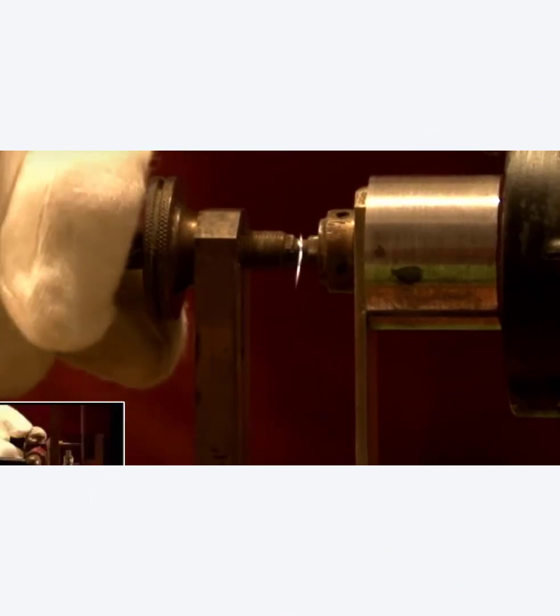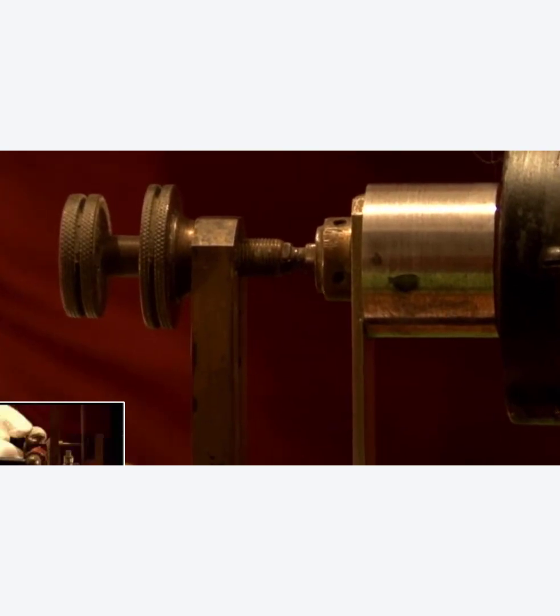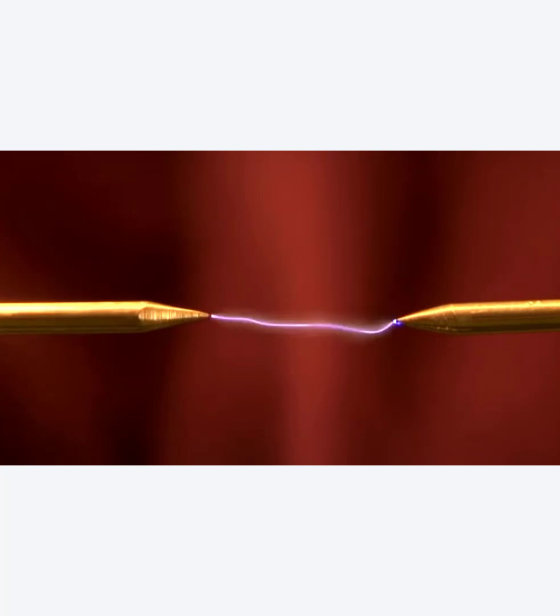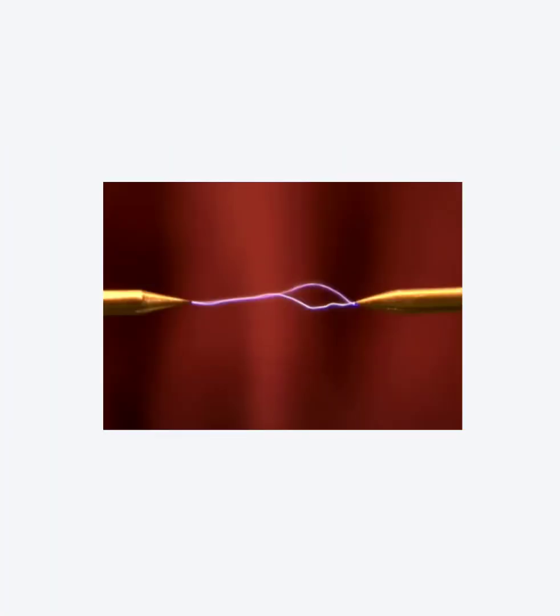Here is a clip of a coil which has been turned on and off rapidly by a vibrating switch. The voltage created each time the switch turns off is responsible for the sparks that you can see. To make electricity travel through the air like this takes about 10,000 volts per centimetre. So if this spark is jumping an 8 centimetre gap, the voltage must be around 80,000 volts.